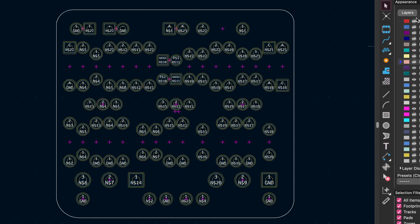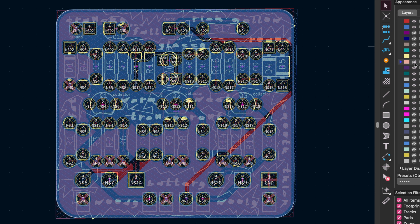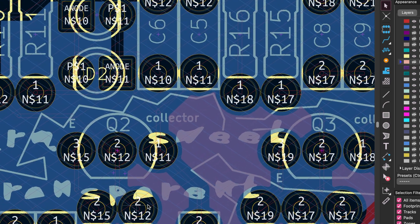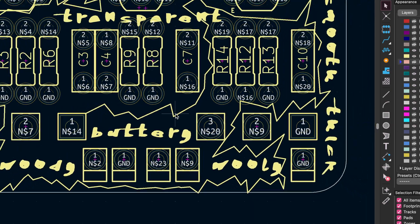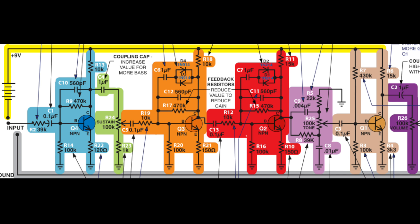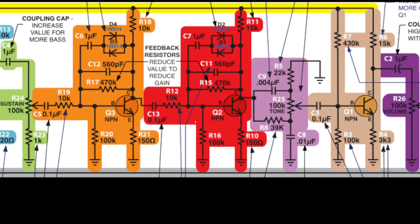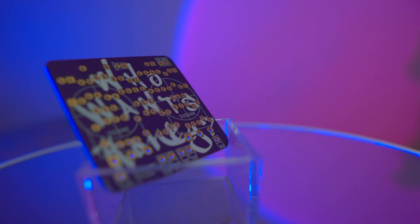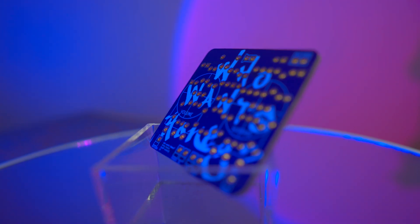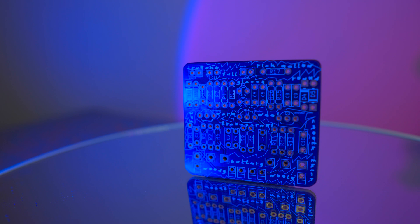After the breadboarding and figuring out what components worked well with each other, I decided to design my circuit in EagleCAD. This means I'm able to purchase PCBs and print them with my design. My design is based off the BigMuff — kind of a no-brainer. The BigMuff is a very unique, distinct-sounding pedal, but I wanted to modify it to simplify the circuit. The first thing I did was remove the tone stack, which also made things smaller. The next thing I removed was the fourth transistor, which is just a gain amplifier at the very end. So essentially it's a BigMuff without the tone stack and three transistors instead of four — a hot-rodded, bare-bones pedal that gives you that pretty crazy BigMuff sound.